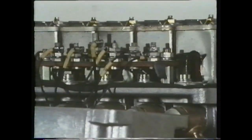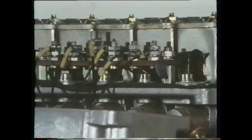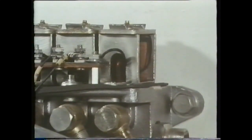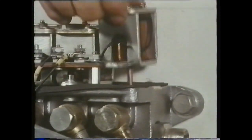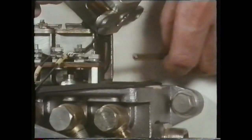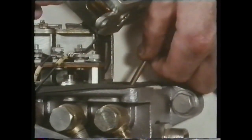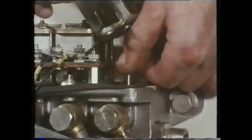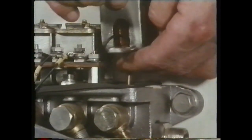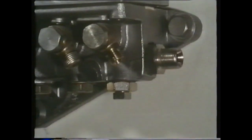If air passes to the second gear from the EP during the manual operation, then the valve mechanism is in order and the fault will be found to be in the solenoid or in the wiring between the plug socket and the solenoid. Each gear has a separate solenoid and each solenoid has a spindle, like this one, which is, in fact, the exhaust valve. The EP unit, being a modular construction, allows for the exchange of faulty portions of the individual solenoid assemblies or, depending on your local service facility, you may exchange the complete EP unit.